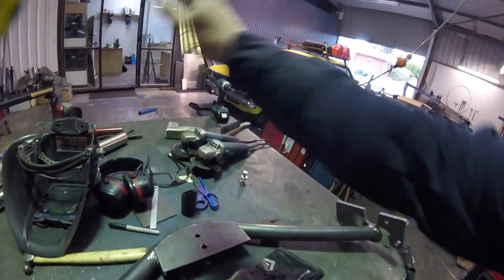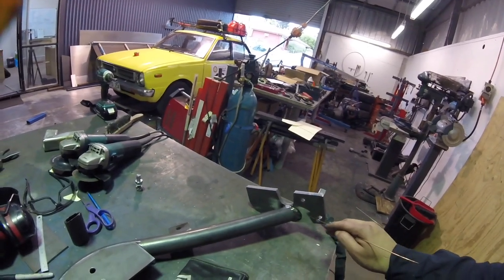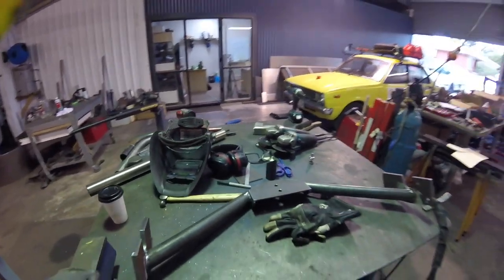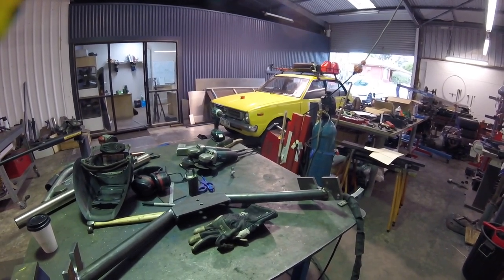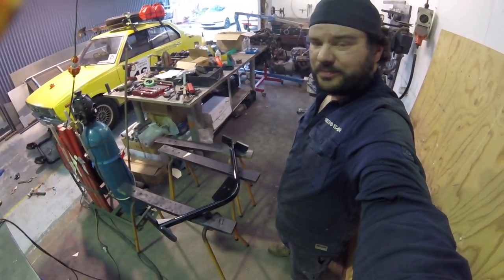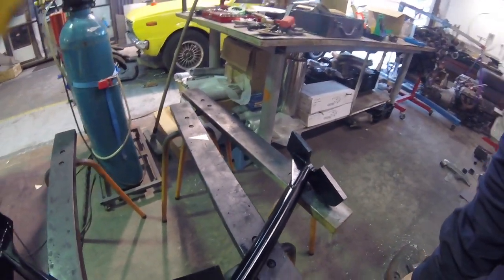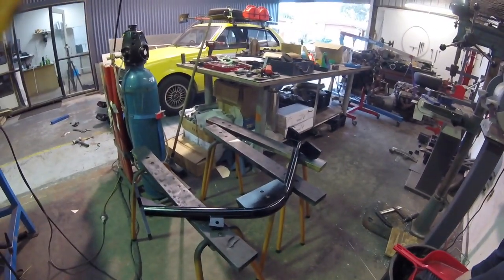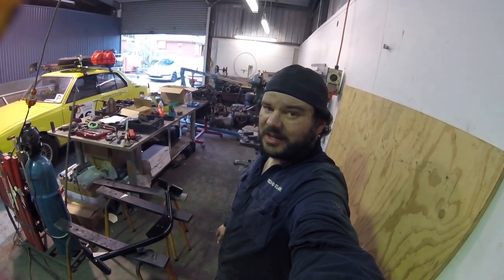Getting yanked out of a big hole somewhere — I don't want to put loads of stress on a single weld, so we'll put a brace in here and just spread some of the load out at the corner. I think that will probably be sufficient. She's a pretty little car but it's nice to tinker away and make this sort of thing. Cut some last braces, weld them in, and away we go. Just gave it a quick spray to make it look a little bit nicer — Chris did say he was going to do it, but I don't like stuff leaving the shop unpainted. You can see the gussets in there — will help me sleep much better at night when this thing's getting yanked out of a big ditch. That's all sorted. Next part of this job is to get the bash plate on — I'll chuck the car on the hoist and get underneath; he's already got a bash plate, we just got to fit it.